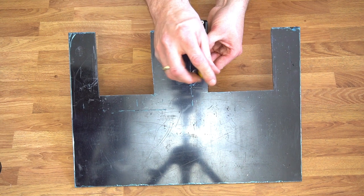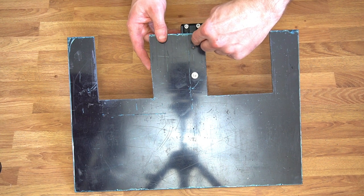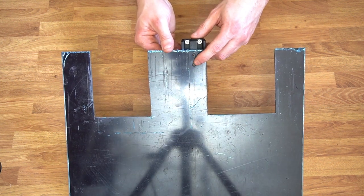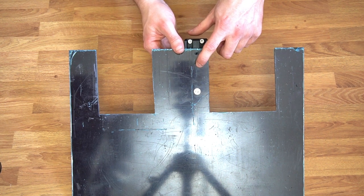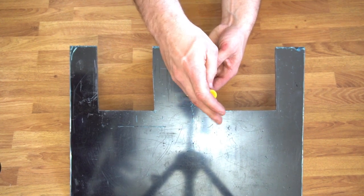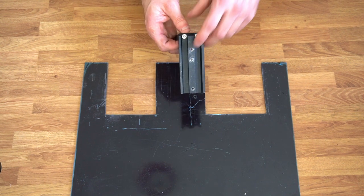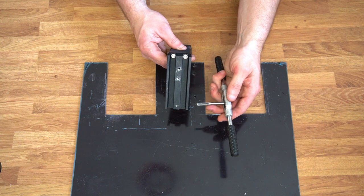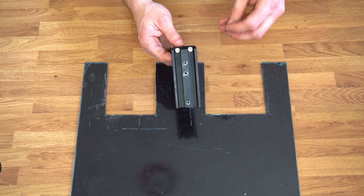So once I lined it up with the bracket, I found that you can angle the bracket along and then you can drill all the way through bit by bit using a 1 mm drill bit or a 2 mm drill bit. And as you go through this, one thing I found out is that I drilled the initial 5 mm for the plastic, but for the metal itself, after I've marked where the hole's going to be, you will see that there I used 4 mm holes. I drilled all the way through, and I used a 5 millimeter threading tool and tap, and I tapped all the way straight across, creating a metric 5 thread.